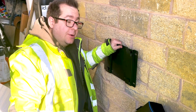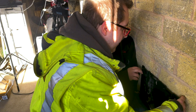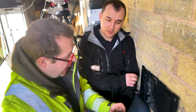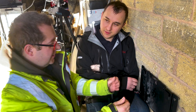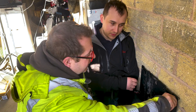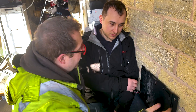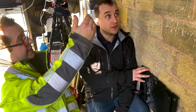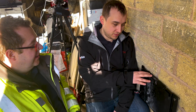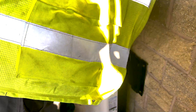Lee, you've ended up putting it on the wall but you didn't use any spacers - why? These expansion bolts have a hard stop, so we can get the bracket the correct distance off the wall. When we tighten it up, it expands out and locks the bolt in position with adequate space. That's basically fixed the issue we were going to have. We just need to copy the same thing above so they're standing out at the same distance. We'll put the battery on now to make sure we've got the spacing right and that it's spaced off the wall correctly.